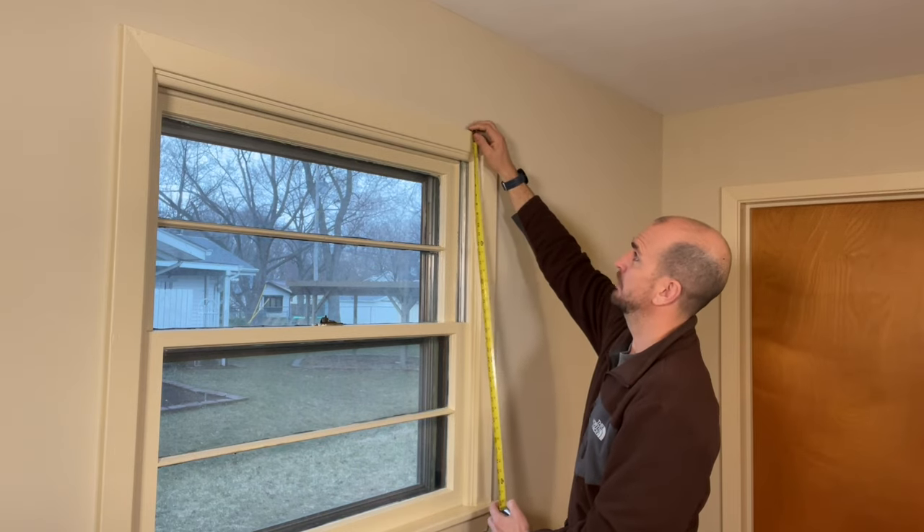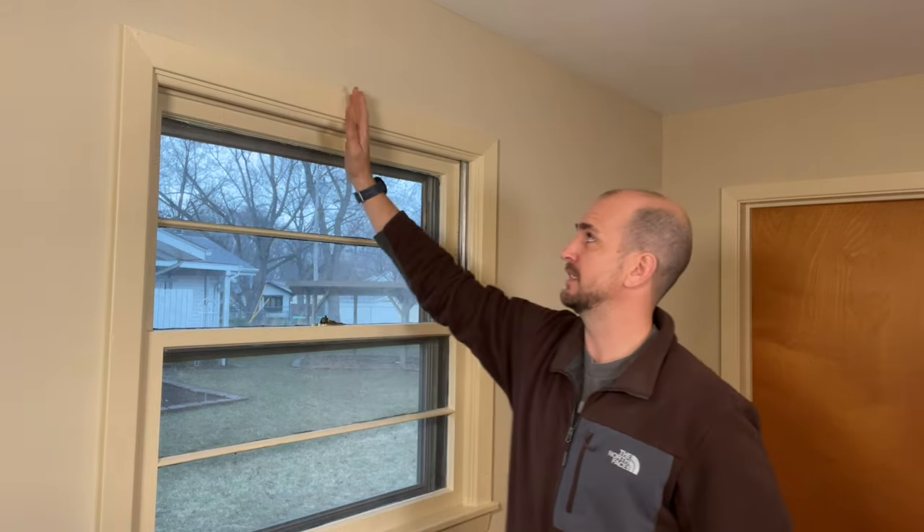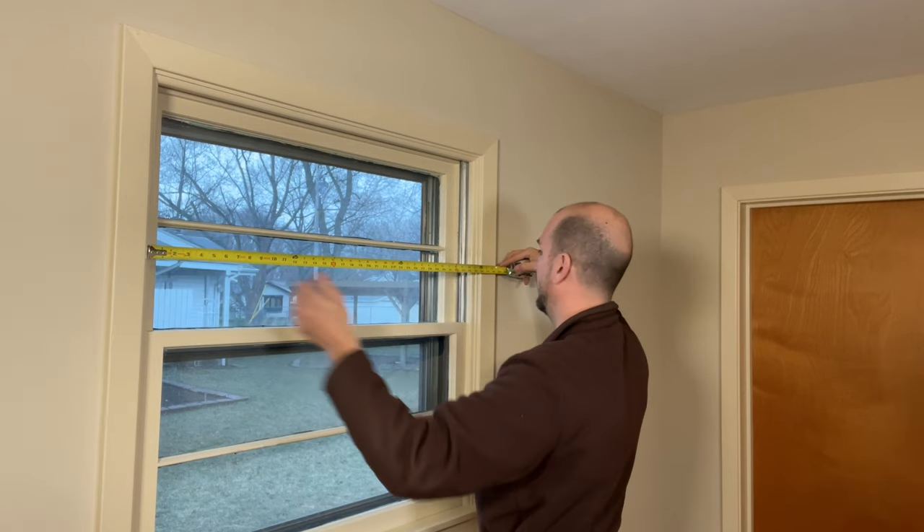Length is pretty easy. 72 inches and 64 inches are the default blinds you'll see at your home improvement store, although you can also get blinds online — Amazon has a good selection, especially one inch vinyl blinds, with links in the description. I'll be mounting to the top surface of the trim. I need about 40 inches. For outside mount, you do not need to measure left, center, and right and take the longest — that's more for inside mount and would be overkill here. For width, I measure from window frame to window frame: 36 and a half inches.